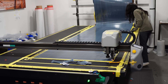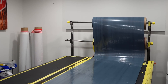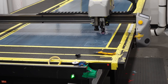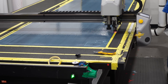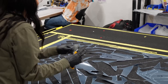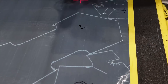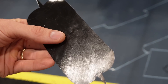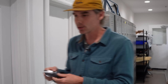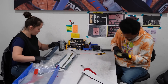Here is the cutting and kitting room. Here we're going to roll out material — the flat sheets of material — and it's going to be cut into flat sheets. Those sheets are then going to be pre-stacked according to whatever parts are going to be made that day. At Allied we use prominently unidirectional pre-preg. These strands are all running in one direction and the resin is already pre-impregnated into the material, so when it comes off it just needs to be formed into the final part shape and then it's ready to be cured.